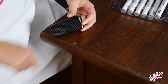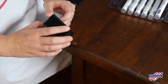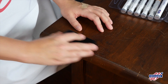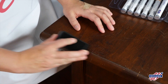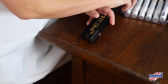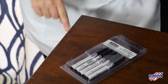We're gonna let that harden for a few minutes. It's been a few minutes and the hardfill has completely hardened, so now I'm going to use the Mohawk leveling tool, which is just a plastic block with ridges on it, to level this down to the same surface as the desk. Place it over the hardfill and use light pressure to move back and forth. Don't worry about scratching the furniture — just keep testing it, and as soon as your finger can run over it without catching on the edges at all, you're done.